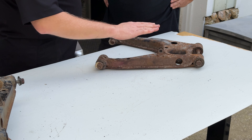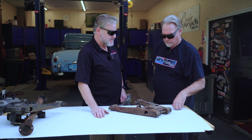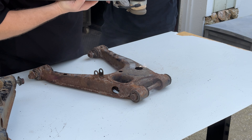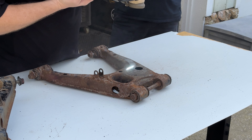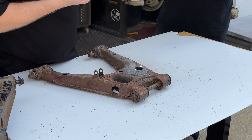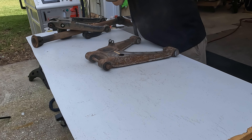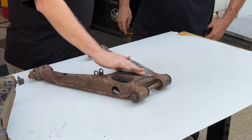You can calibrate it to a smaller power to polish it even more if you want, or vice versa. Is this the widest pattern this one makes? No, this is 20 millimeter by 20 millimeter. If I go 100 millimeter by 100 millimeter, that's about 3.96 inches by 3.96 inches. You have to be careful with delicate parts in a bead blast cabinet, but this doesn't really injure the metal at all — unless you get to the higher power levels. You've got to fine tune what you want based on whether it's aluminum or steel. The finishes all come down to the power. For a nice polished finish, lower the power with a wider XY grid and go over it until you get exactly what you want. On aluminum wheels, you can make a fairly smooth finish — you might not have to do anything else afterwards.